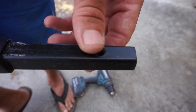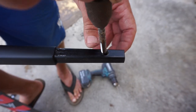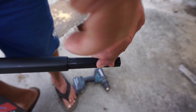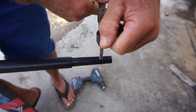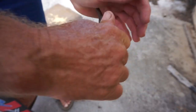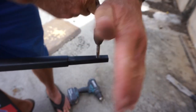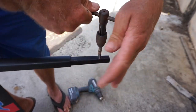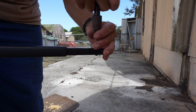What you're basically seeing is carbon — this is solid carbon fiber prepreg. You can see there are threads in it because we've done it before. We're going to run new threads through it to make sure they're clean. What you do is go backwards and forwards with your tap — if it binds up, just go backwards and the carbon will fall out of there. So I'm going backwards and forwards, and you can see how the tap is going to come through the bottom. And I've run brand new, clean threads through this fuselage. When you back out the taps, always go straight up — don't try to get them cockeyed and crooked.